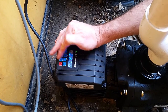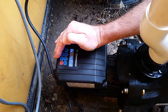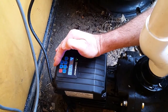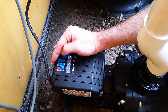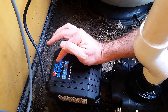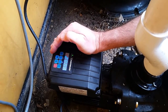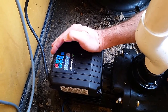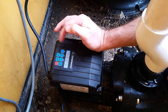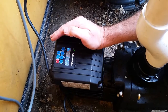We might set speed 2 to around 2800 rpm, and you can also set it to run for a set time — say four hours. So if you wanted a water feature or waterfall to run for a couple of hours while you're having dinner, you press V2, it runs for that time, then turns back to V1. V2 only kicks in when you physically press that button — there's no automatic timing on it. The main speed is V3 at 2000 rpm, which is enough to run the TPC cleaner around the bottom of the pool, and we've set it for an hour and a half. Twice a day that's three hours of cleaning time, which is enough to keep the pool clean.